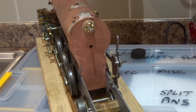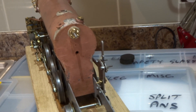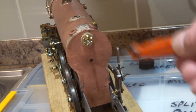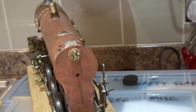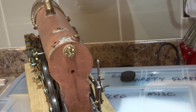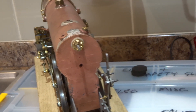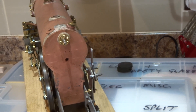I've made a mistake on the remade boiler. If I didn't make mistakes I would think it was somebody else building it. What I've forgotten to do is to put a lower bush on the back head here for the bottom of the water gauge. Not a big deal. I can fit a bush there after I've done the pressure test, which I still haven't done, using high melting point — say 300 degrees C or something like that — high melting point soft solder. Because if this back head gets to anything like that temperature, life has already gone so wrong it won't really matter.